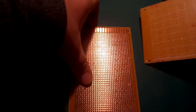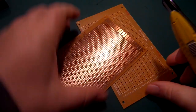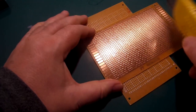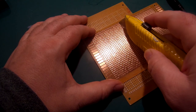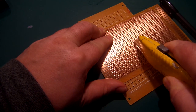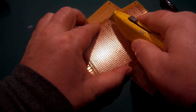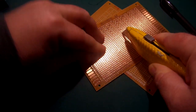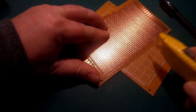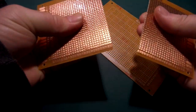Just put the board on a bit of other stripboard, and you don't really need a ruler unless you've got a particularly shaky hand. Cut along the 22nd line — and please keep straight now that I've said you don't need a ruler! Just cut along there like that, take it from the other side as well, go along again. That should just snap now — which it does. That's our board.